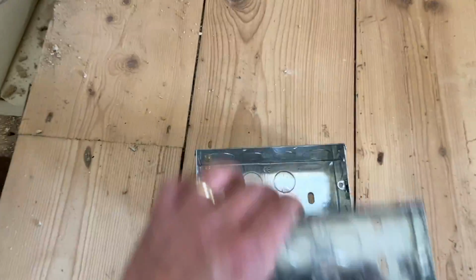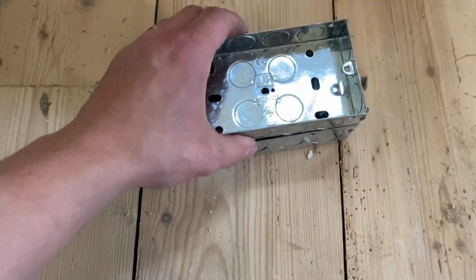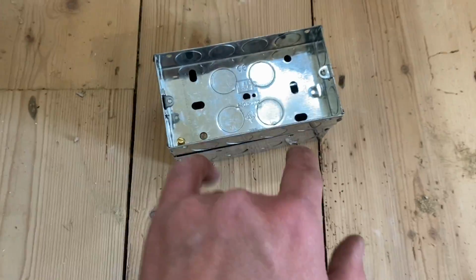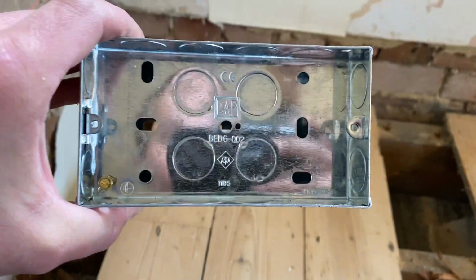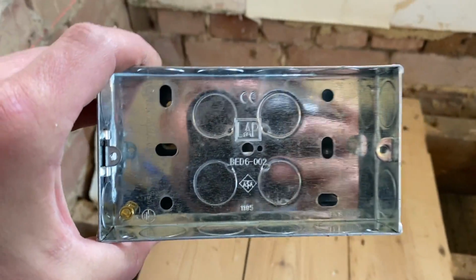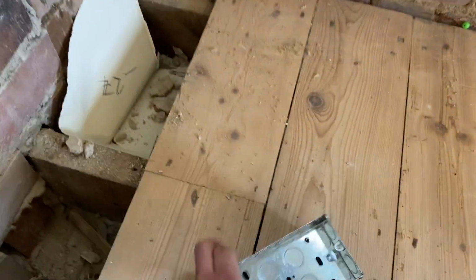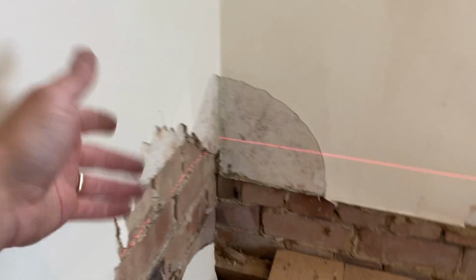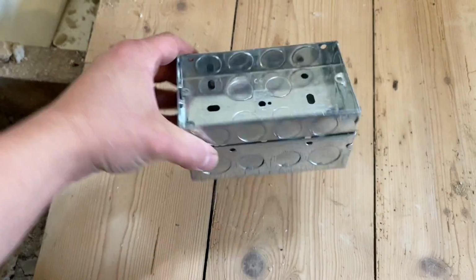So because the client is battening out the walls, I've got some 50s and some 25s. I haven't got any skeleton boxes, so we're just gonna bolt those together like that. Let's drill through the holes, long screws, come in the back there, come through the socket there, and that's gonna give him his 75mm. Because what he does, he fixes a batten to the wall, 50mm batten up, because these walls bow, so he's not gonna fix to the wall as such. But we wanna get finished and on rather than putting horrible plasterboard boxes in, so we're gonna use these, okay?